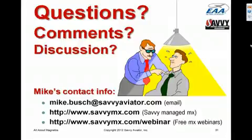Sorry. Okay, and Nick says, you've described the in-flight mag check in another recent webinar. I tried it on my twin Cessna a couple of weeks ago, and both engines ran too rough on one mag for me to leave it running that way for 30 seconds. I was in lean of peak cruise. Does that mean I should have tried the test more rich, or does it mean I observed a problem with both engine ignitions? Probably means both of those. But if you're saying that it ran uncomfortably rough on one mag but not the other, then for sure you've got an ignition problem that you need to look at. If you were running uncomfortably rough on both mags, then possibly you were just running it a little bit too lean. But it sounds from the description like the mag test did exactly what it was supposed to do, which is to tell you that you've got a problem.